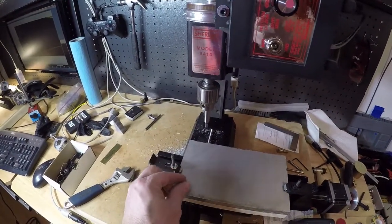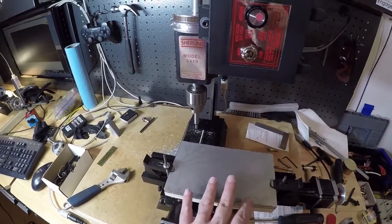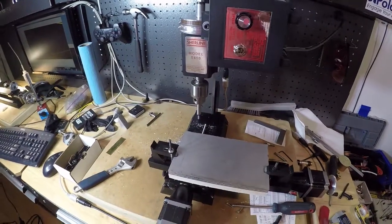But I think nothing's going to beat a center point hole on one of the engineered drilled holes. So with the center finder, that should be the best. All right, let's go ahead and indicate this guy.